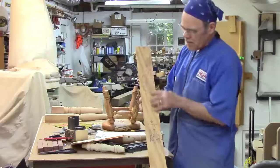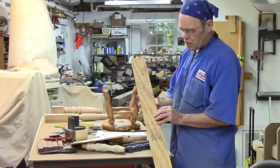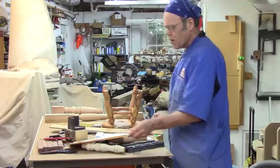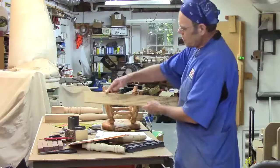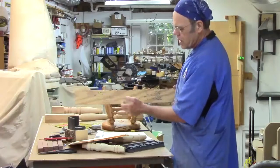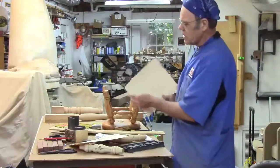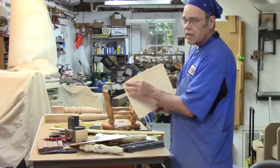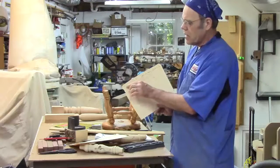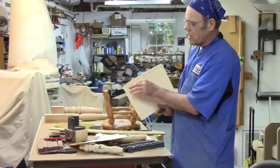You can see this storyboard, and that's what they call this, a storyboard. You make it out of a quarter inch sheet of plywood or a thin strip of wood. Some of the rules for the storyboard are that the longitudinal dimensions ought to run one at a time. Draw them with arrows connecting from feature to feature that's going to be significant as you lay it out. Each arrow touches on another area, and then draw the dimension inside in a broken area.